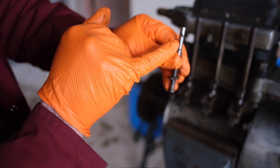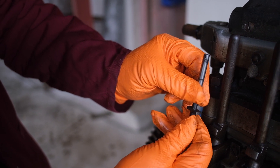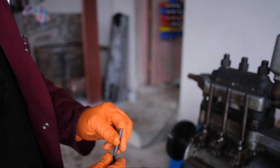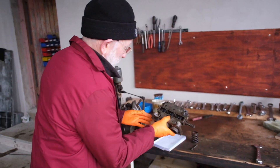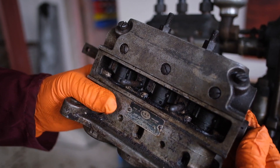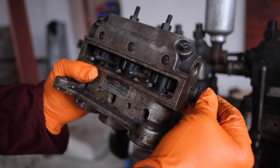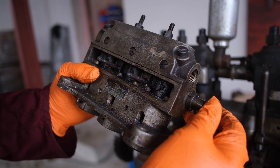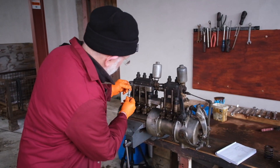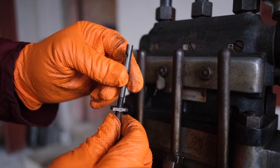This shaft here has got a helical groove in it, and what it boils down to is that as it rotates inside the pump top, it governs the amount of fuel the engine is getting. This element here is called the rack, and it must be feather-free inside there. If it's stuck in any way, the pump won't work at all — it'll be ungovernable. That little component is rotating in there with the position of the throttle, and that controls the amount of fuel the engine gets.